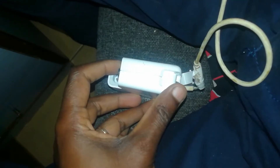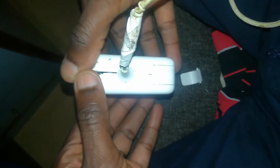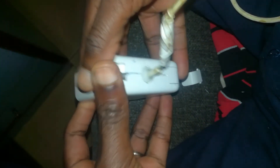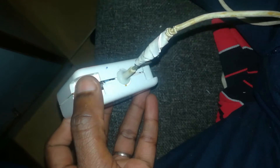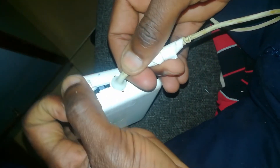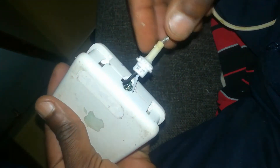The first step is to open our MagSafe charger. This is a tricky procedure, but with a pair of long-nose pliers or any other pliers you can pry open the MagSafe charger at the edges where the clips fall into. Put your pliers in there and pull the MagSafe covers apart. Put your clips somewhere safe so you don't lose them.